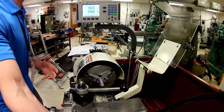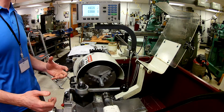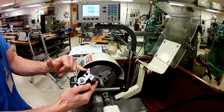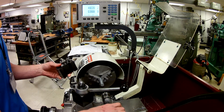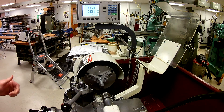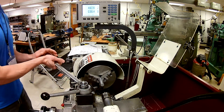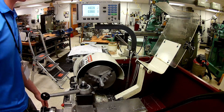This isn't the worst thing in the world — we have a couple of options. We can bring our tailstock back up like we've done before and use that to line this up. But sometimes it doesn't necessarily have to be a precise science. While you're cutting, as long as you have clearance at the tip and not hitting elsewhere, the orientation of the tool doesn't matter as long as it's reasonably close. So I'm going to grab my wrench, break this loose, turn it to where it looks reasonably close, and snug it back down. Is it perfect? Probably not, but I don't necessarily require it to be during this operation.